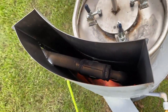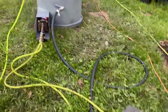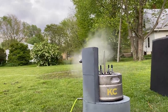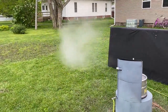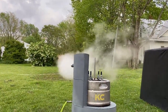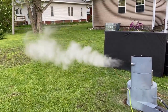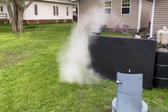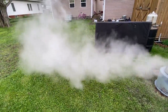Here's a look down inside the super heater area — that's where our exhaust port is also. It's windy outside, so the flow pattern of the steam is not natural. I'm going to turn this blower down and have a look at what happens. That's with the blower on full power — a three-stage compressor, so you're looking at an extreme amount of air. I think having it set at about 25% power is optimum — best of both worlds. It puts out a lot more than just steam alone, and we're able to use a lot more of this waste heat this way. I just wish it wasn't windy so we could see what this thing could really do.